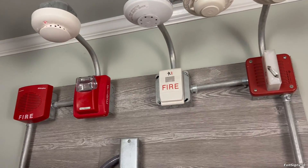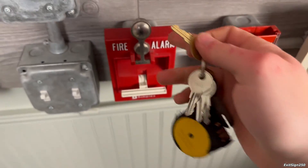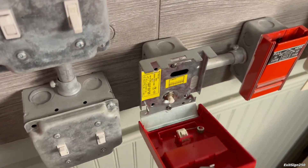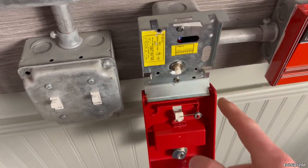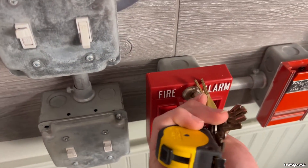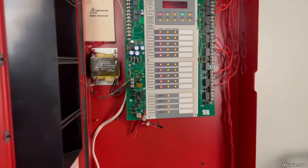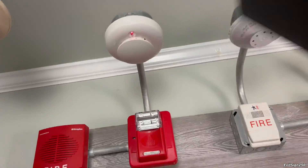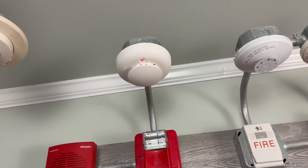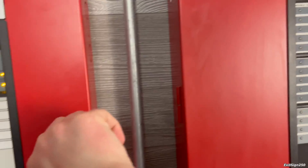That was both of these systems in alarm at the same time. While this ESL smoke is airing out, let's reset the T-bar and check out the model — it is model 2099-97-96. This was addressable by the way, but I converted it to conventional. Let's reset this system. I'm waving a piece of metal to make sure we won't get a re-alarm. Now let's reset the system — and this is beeping because there's no batteries.